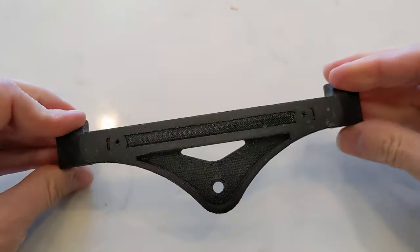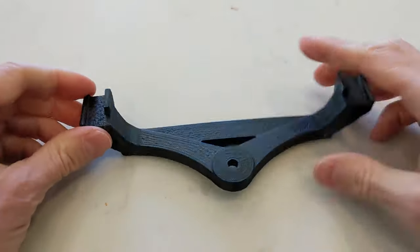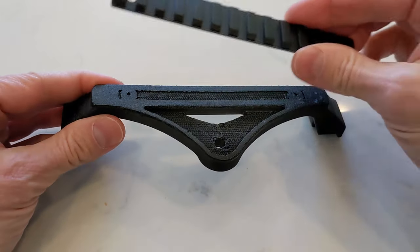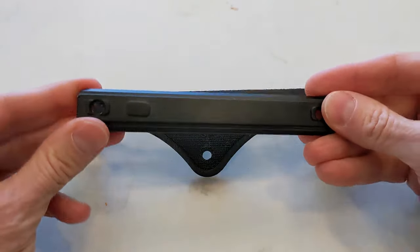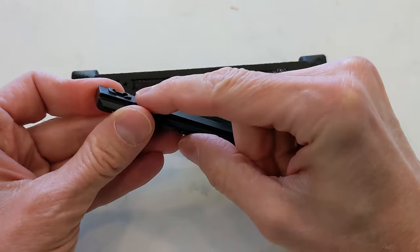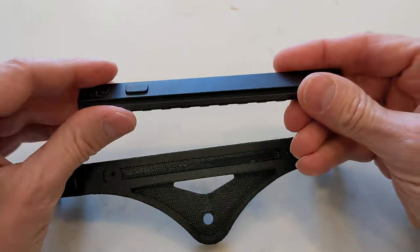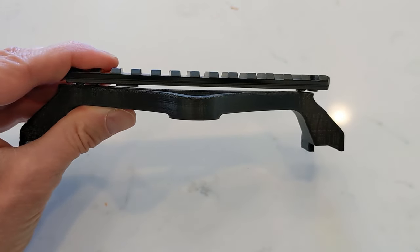Here is the finished product in real life. It's actually very strong and rigid — doesn't really bend much at all. This is the orientation at which it was printed, and this would be the last surface that was printed. This is the way it mounts on the Bronco, and here is the picatinny rail that will fasten on top. It'll give us lots of flexibility. The picatinny rail, which I'll link in the description — purchased from Amazon — has on the bottom of it these pieces that stick out a little bit, making it wobbly when it sits on top of the printed piece. So I'm actually going to grind off those protrusions so it'll mount nice and flat on the finished piece.